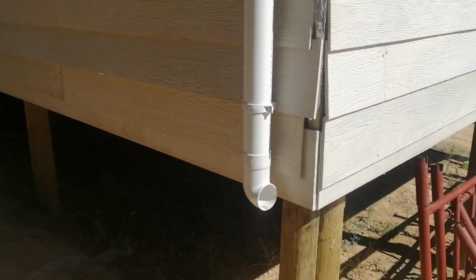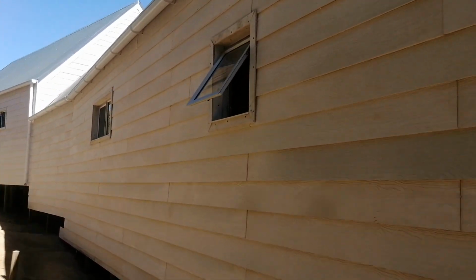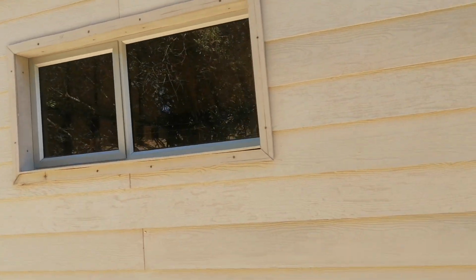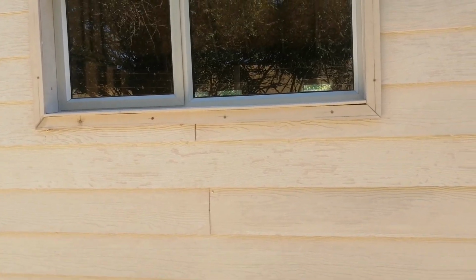And the gutters and the downpipes are in. This window is framed as well, inside out. We are going to see fiber seal on all these joints, where a screw again is going to be done to flush. We need to flush, then after flushing we'll obviously put the fiber seal. So all these gaps that we are talking about, we are going to flush by adding additional screws from the top, from the tip here. And then once we get the chipboard screws in, those small gaps will close with the fiber seal.